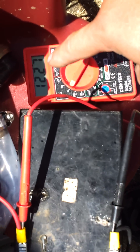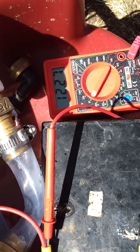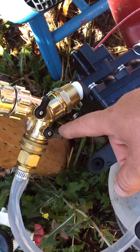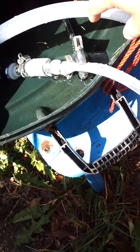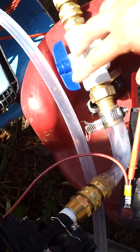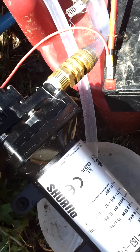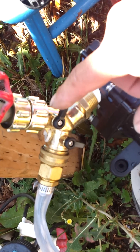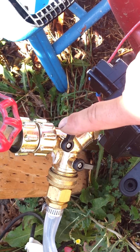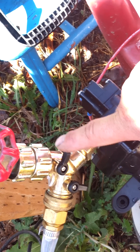This is the 12-volt battery reading 12.27 volts when it's off. The bottom pump connects right here — the hose is about three feet long with three-quarter-inch suction, a filter sock, and I'm leaving the choke open. The house is on right now — the city water is off and this pump is back-feeding the house.